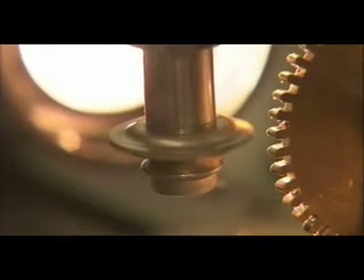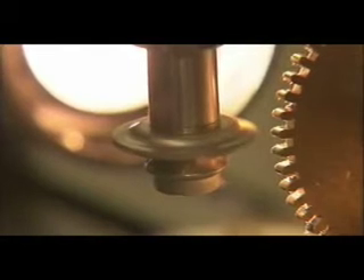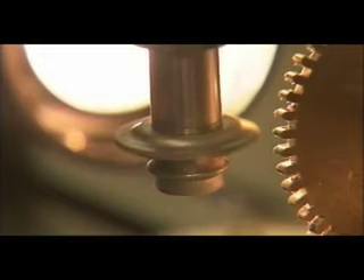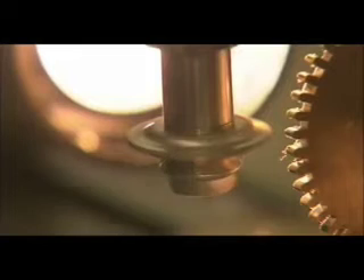The cut of each tooth — the separation between the teeth — we dial in the next. This little stepper motor moves the whole rig around until it comes to the next tooth that has to be cut, and so on until the whole wheel has gone around a full revolution, and we have 48 teeth cut in the wheel.